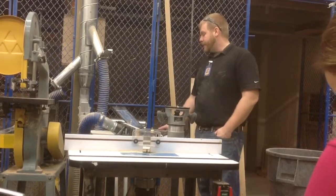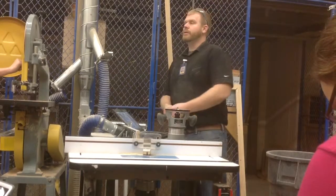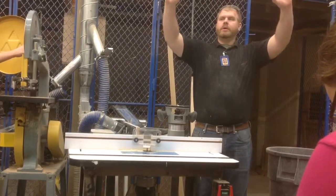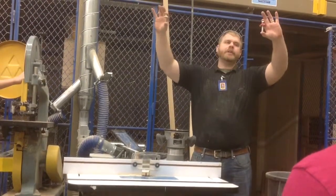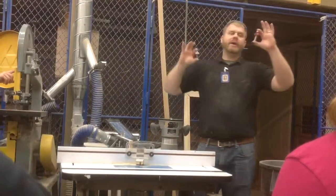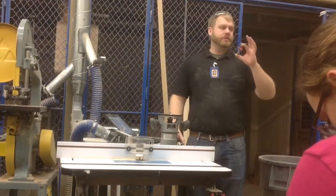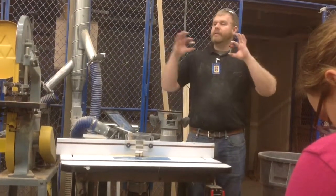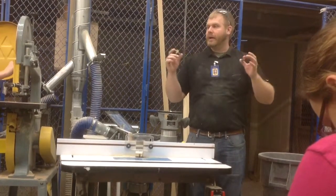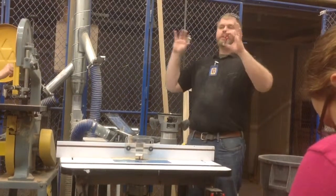Number seven: the most common shank sizes for the router are one-quarter inch and one-half inch. Here they are — one-quarter inch diameter and one-half inch diameter. These both work great. If I have the option, I usually go with the half-inch diameter shank because it gives me a little more weight, which reduces vibration. However, they both work. If you use a router long enough that you actually break the shank off, congratulations — that's a long time to have a router bit. These are usually about a dollar more than the quarter-inch, and the average router bit is maybe $25 depending on the quality.